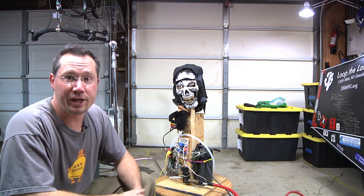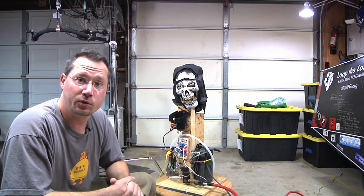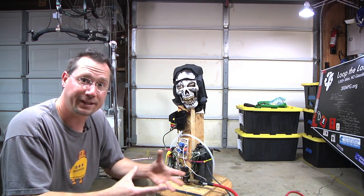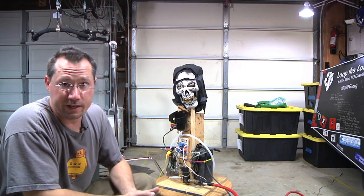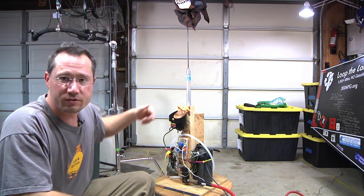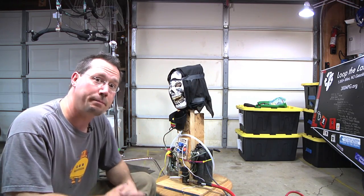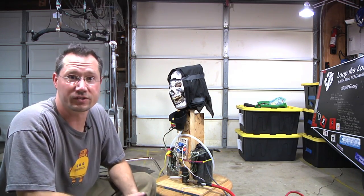Without this inside the garbage can, it's a little easier to see. Basically, it's an air cylinder hooked up to a remotely controlled 12-volt DC air valve, and that's controlled by a light sensor. So if I cover that light sensor — there goes the head. It shoots up, it turns on some lights, and it also provides some power. I had a radio hooked up to this, so we had some noise as an element here too.